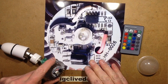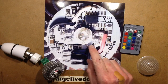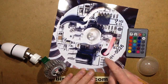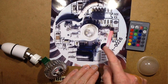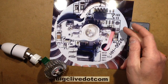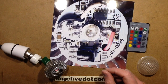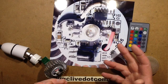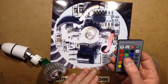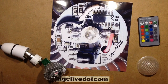It's an interesting little light — it's basic, it was cheap, a generic little thing. It's interesting that it's got that extra function: the white wire coming in provides a signal directly to one of the input pins of the chip. It's also notable that it has a position for another chip that might have memory functions, and also a footprint for a longer chip — maybe that's just for manufacturing versatility. But yeah, interesting enough — it does work. I feel better now that I've tested it from a distance.